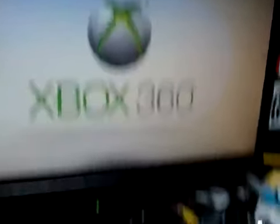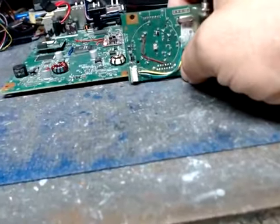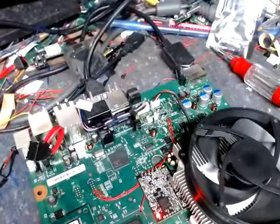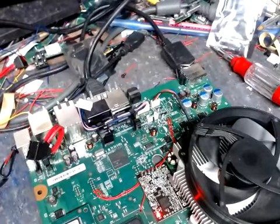Now we did that. Now we're gonna shut it down, and we're gonna select NAND 1. There you go — that's the hacked image. You will notice that the chip will blink differently. It's gonna pulse, pulse, big pulse, and then boot — hopefully. Now mind you, it's not timed, because I use a modified timing file to start off with that I know usually boots. Then once I get it in the chassis, I adjust the timing file, because the chassis changes everything — it's radio waves, interference, and all that. Plus you have the DVD drive, accessories, Wi-Fi, hard drive, and everything else. So that changes everything. You gotta time it after you put it all in the case if you want it to boot right, otherwise you're gonna wind up with a mess on your hands.